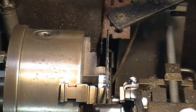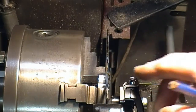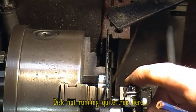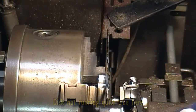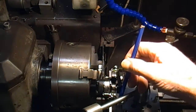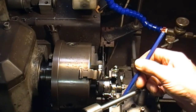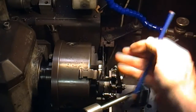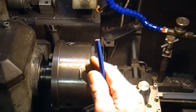The lathe carriage saddle is positioned so that the fixed pad on this side is almost touching the disc. This side is the moving cam-operated pad, and when this operates you might see there's a tiny bit of movement on the caliper body. That's because there are two spring-loaded bolts which actually allow the whole thing to move slightly, which is very beneficial.